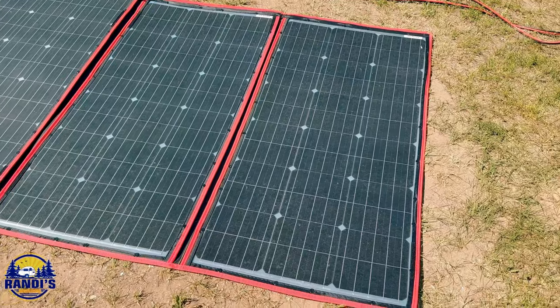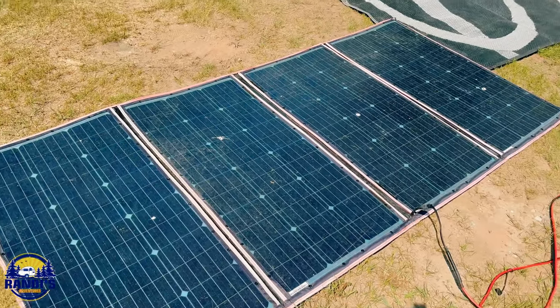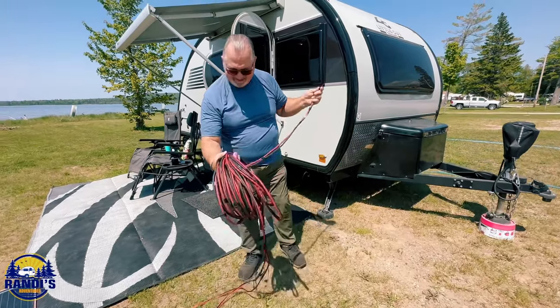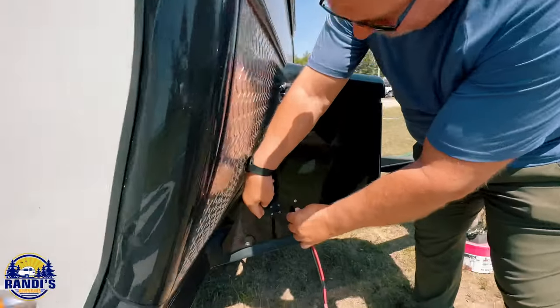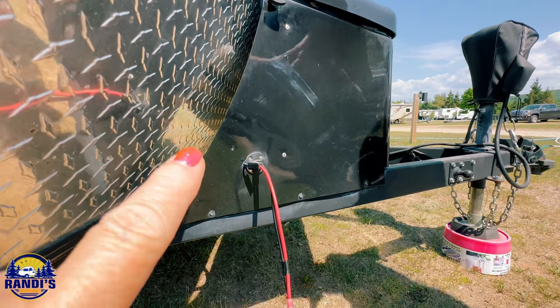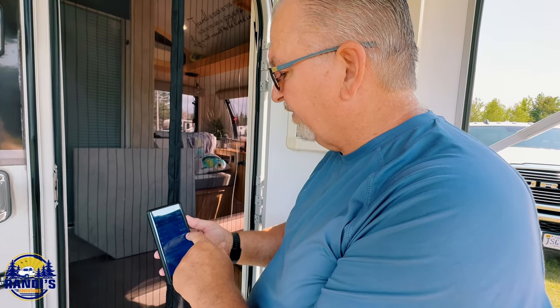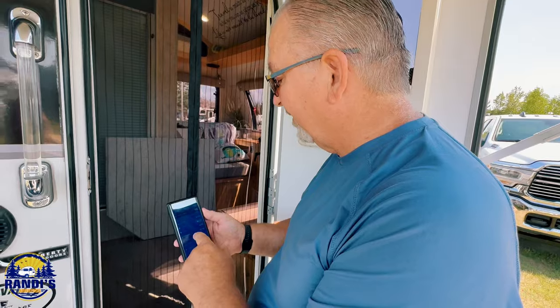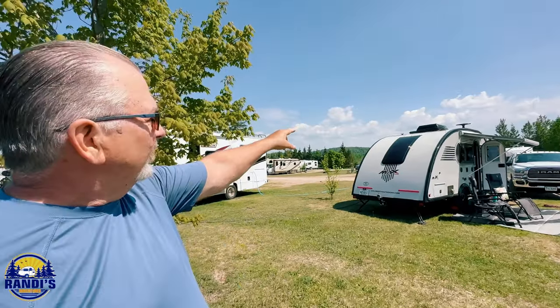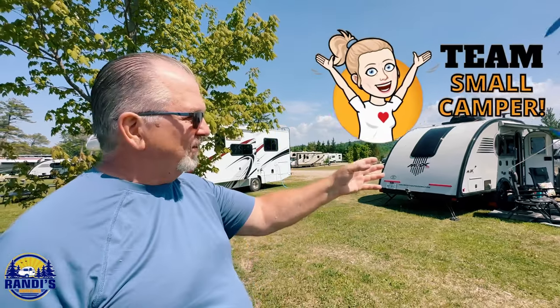Crazy — 600 watts on each panel. Are these both the same kind of panels? Yeah, that one's just a couple years older, and that's why it's faded a little bit. It's been out in the rain. This is 50 feet here, actually. Now I'm out of this here, so I can just plug in. And so now this is hooked to the battery and it's going to charge the battery. It goes directly to the solar controller in there, which goes to the batteries. So it's getting in almost 1,000 watt hours between the solar and being plugged in. We got the original 100 watt panel that came with the camper, then a 50 in the middle, and then 110 watt on this side, which gives me a total of 260 watt hours. Plus the 600 on the ground gives me 860.